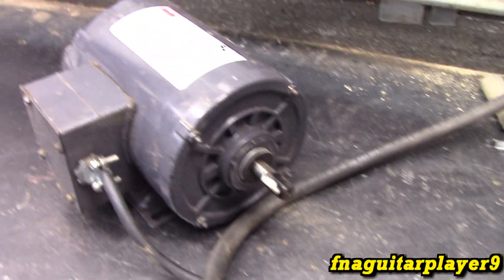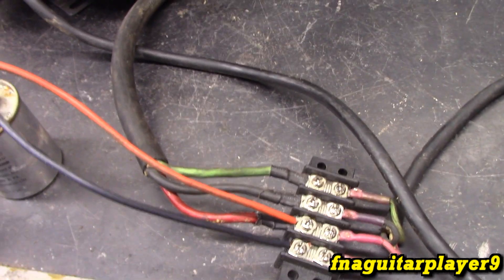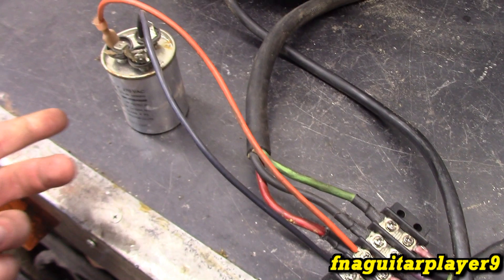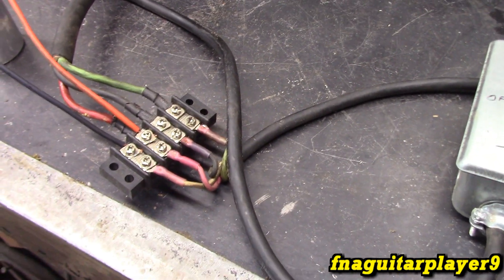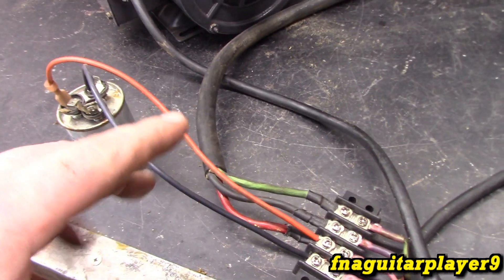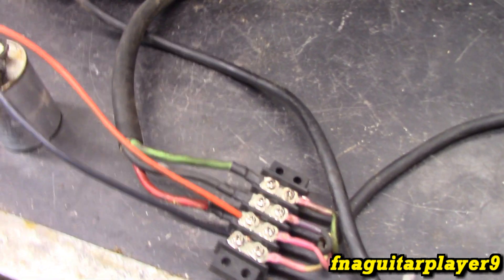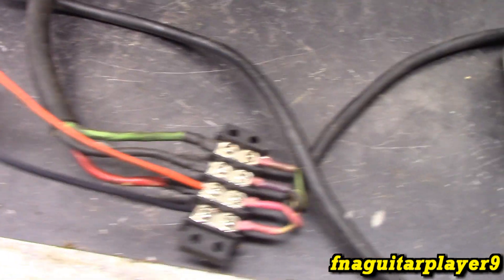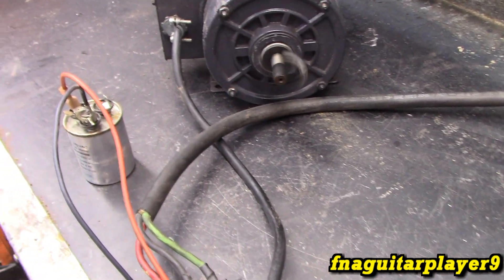My only concern is I haven't tested it with a motor under load and running for a long time. I don't know if this could actually cause damage to the motor — like overheating — or even the capacitor for that matter. But you can still reverse it by switching two of the three phases around on the motor side. If you had this set up on a momentary switch and just used it for starting, that might be your safest bet, but it will work.